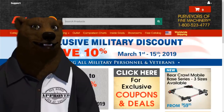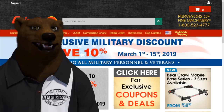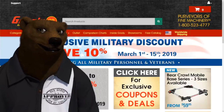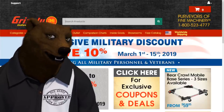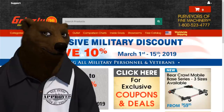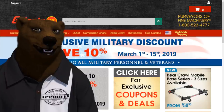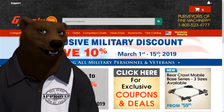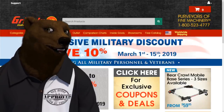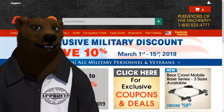All right, then we've got tier two. Tier two comes in and looks at what the manufacturer has and says, okay, we like that, but you've got to do this for us. You've got to meet these kinds of specs. It has to have this level of motor, and the plastic needs to be of this level of quality. A lot of quality control, and also specs about the stuff that goes into it, because a lot of these factories aren't building every single part. They're buying from other factories themselves. So think of it as not quite custom, think of it as semi-custom, where they're looking at a base model going, yeah, that looks good, but we want to tweak it and make it better.